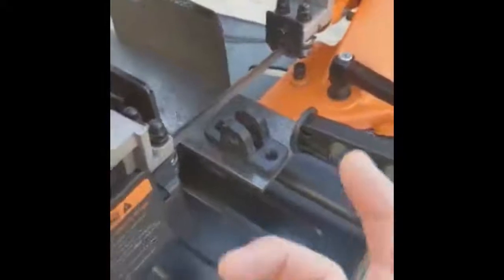We're going to use the two and a half inch flat stock, and we're just cutting it so that it'll fit the bracket right on top there. The two and a half inch is wide enough so that we can then fit the NRS U-bolt underneath.